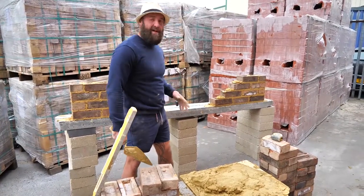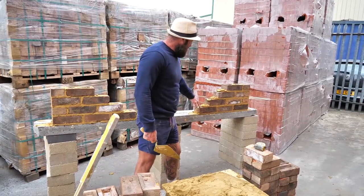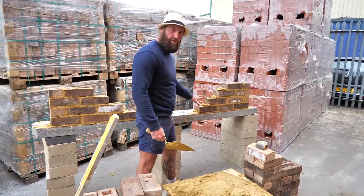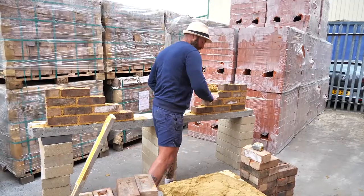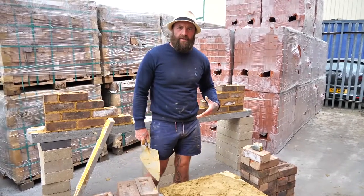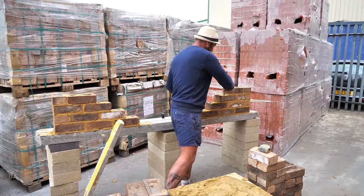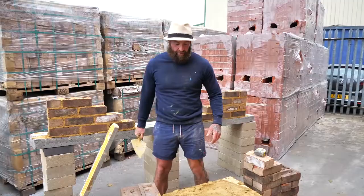So the other corner is now up. Now watch, please. This is what we call the excess muck. In slang bricklaying terms, snots. Make sure you clear it, because it goes off ever so quick. Now, if you're ready to point, use it for pointing. If not, always clear. At the end of the day, your snots off, so it's clear the next day or for when you start laying. Notice I've done this side already.